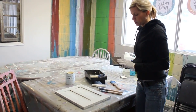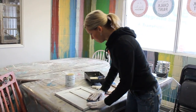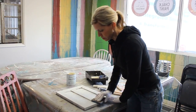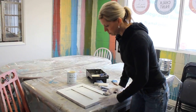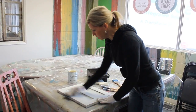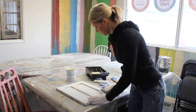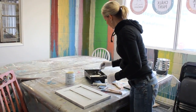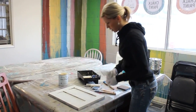Between coats, I want to use a nice fine sandpaper — maybe a 220 grit — and I'm just going to use that paper or my sanding block. I'm going to lightly sand the surface, just to make sure I remove any brush strokes or any hairs that might be in there where I used my brush, or any little blips from my roller, and I can just sand that out. Once I've done that, I'm going to apply another coat. If you feel it's a little bit dusty, you can give it a quick wipe.